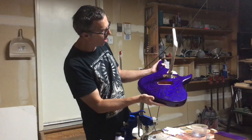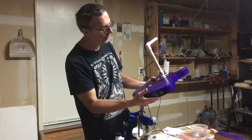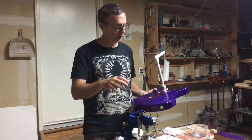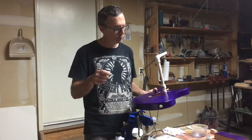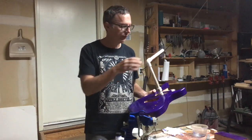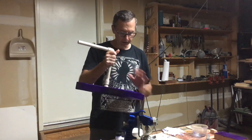This is what I've got so far. As you can see, it's a strong bluish purple — I'd call it almost an indigo. I've already put a couple of coats of the Crystallac over the top. The plan is to build up a coat every hour until I've got around 10 to 15 coats, probably closer to 15. At that stage I'm going to level sand with 400 grit, spray a couple of coats, then level with 600, spray two coats, then 800, spray two coats, and then 800 again and buff. I'm pretty happy with the quality of this finish — it feels quite durable and looks like it's going to build well.